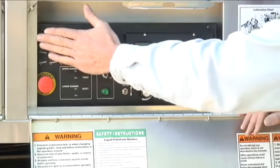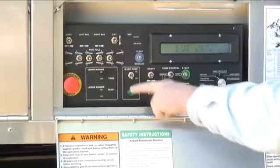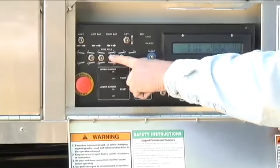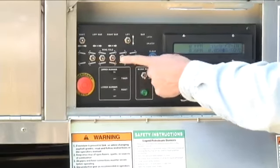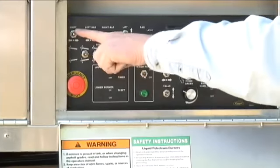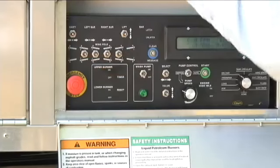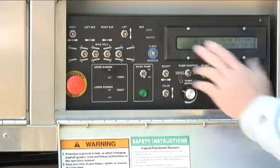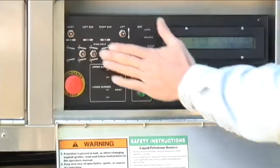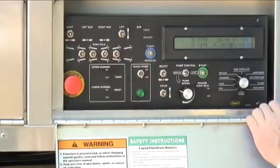The hydraulic functions for the spray bar can also be controlled from here. I can lift and lower the bar, and since this truck has hydraulic folding wings, I can operate both sections of each side of the truck with the hydraulic folding wing switches. I can also shift the bar from here. These switches are identical to the ones in the cab — there is no designation of which one to use. They are wired hot all the time so that no matter what position I'm in, I can move my spray bar.